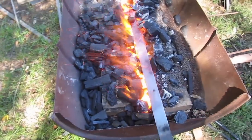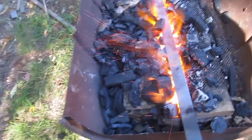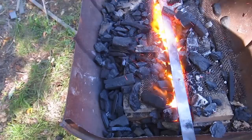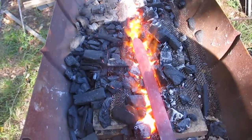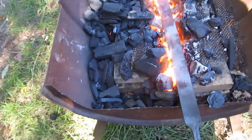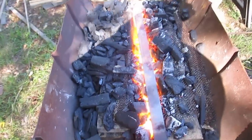Let's take a look. I'm currently heating this sword blade here in the sword forge, and you see how I've got maybe two feet there getting nice and hot? This sword actually needs another foot to get hot, but you get the idea — we've got that long liner very hot. And it doesn't have to be as hot as your normal forge; we only need to get it up to about 1,500 degrees for hardening.